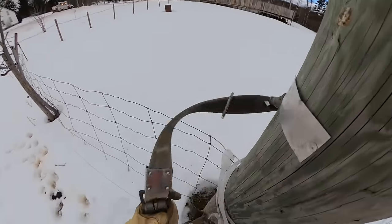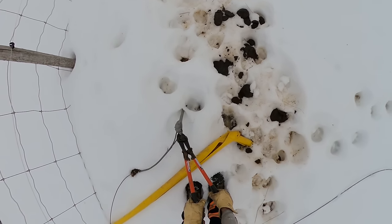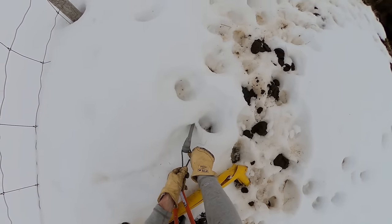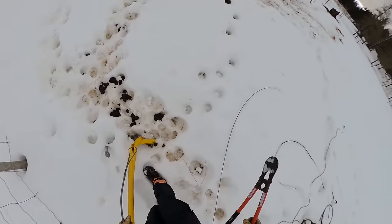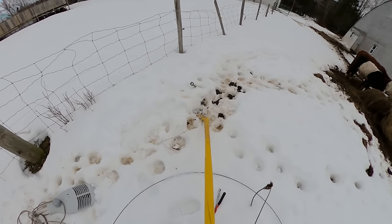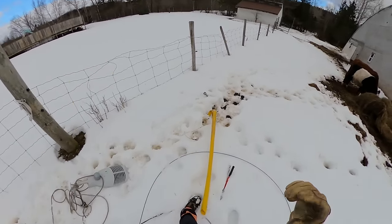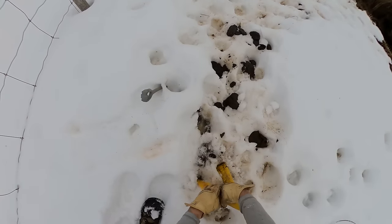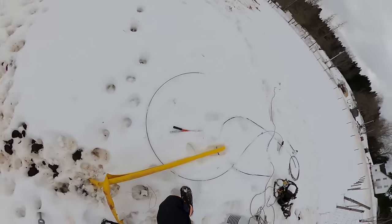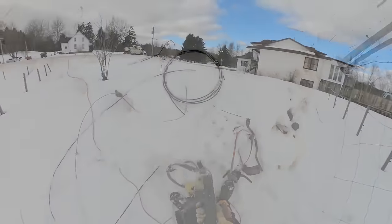Normally I would leave the down guy attached to the pole and use a come-along to pull that anchor rod right up and out of the ground. In this case it's either a log anchor or cross plate - it doesn't have the screw on top so I'm not going to be able to remove that anchor. My guy guard is stuck and completely surrounded in cow dung - that's awesome. We're going to go back, get my Milwaukee Sawzall and a shovel, dig down a little bit, and just cut the head of that anchor rod off.